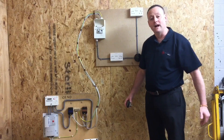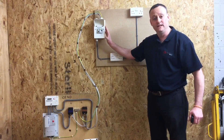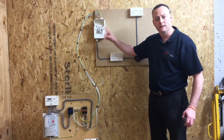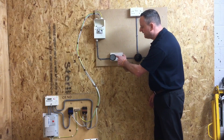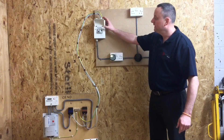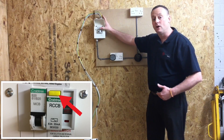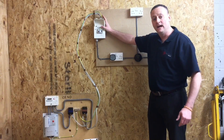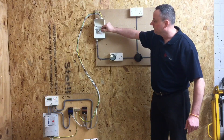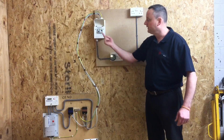We've rechecked polarity as best we can with a plug-in voltage indicator — remember it won't prove a reversed earth or CPC and neutral connection — and we've proved the functionality of the switches, so each switch of the socket outlets turns on and off. We now need to prove the functionality of the glorified switches within the consumer unit — the RCCB and the circuit breaker. Plug it back into any socket on the circuit and leave it on, go to the distribution board, and press the test button on the RCCB. The whole installation goes off, proving the mechanism is functional.